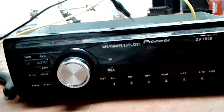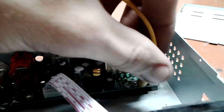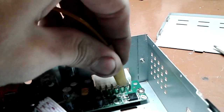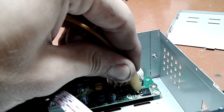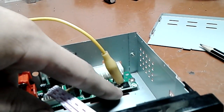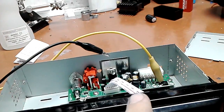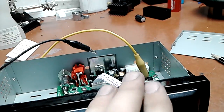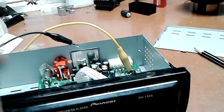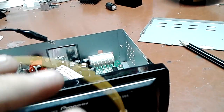switch off, is I go and put this on the input of the regulator, and I will put a multimeter on the output of the regulator, and I will slowly bring the voltage up and see will it stop rising at 5 volts. If it will, that means the regulator is all right, and the only problem is that burnt open resistor.